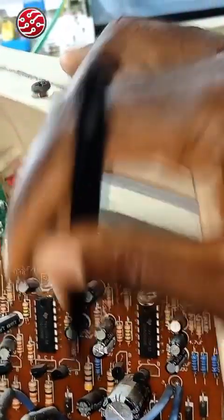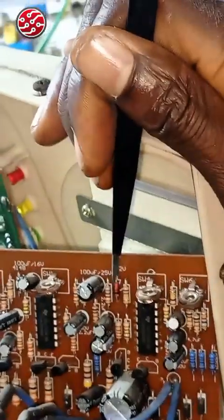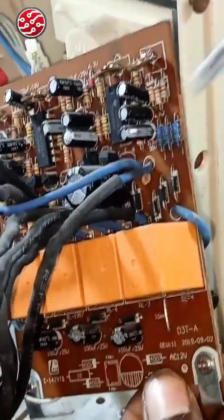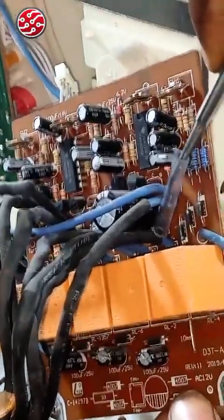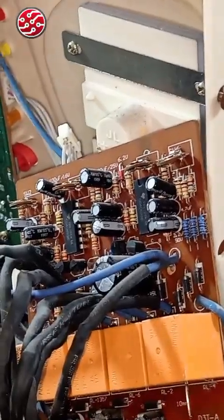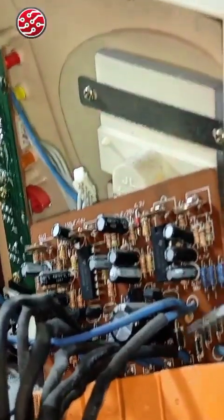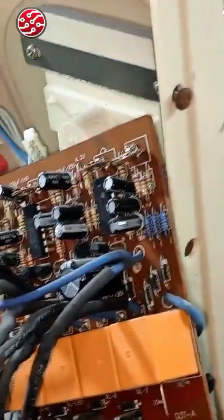When you see a burned component here, check whether the IC or the zener diode holding the voltage line is affected. Now, which one powers the board? There is a big diode inside. This big diode controls the power on the board. If your board is blasting the fuse, check this diode first. If this diode is okay, check these relays — one of them might be short-circuiting the transformer and blowing your fuse. These are the key things to understand when fixing this stabilizer.